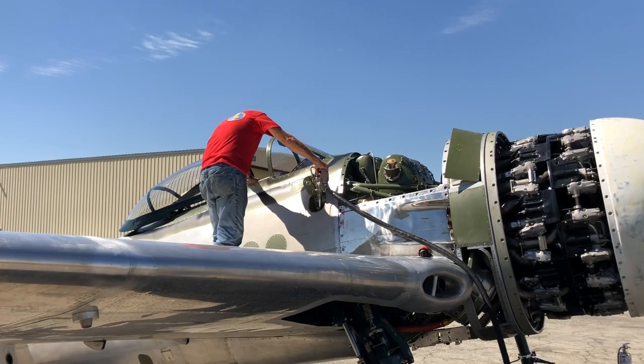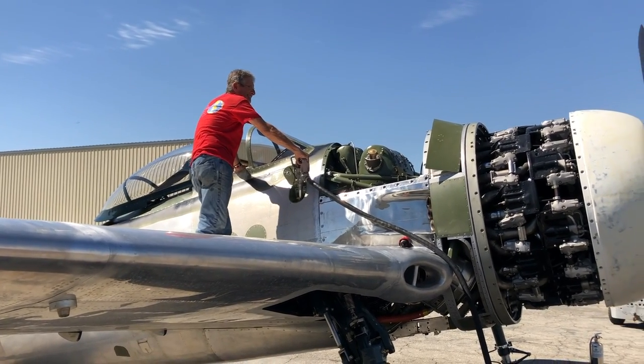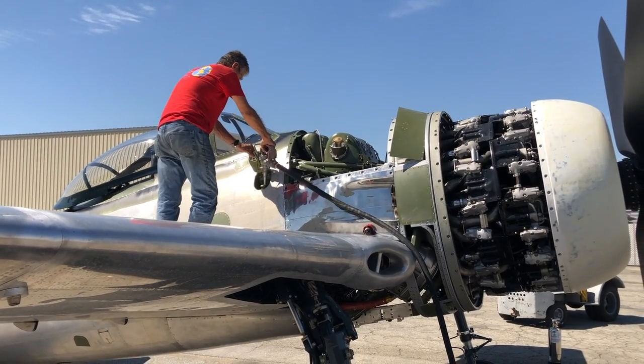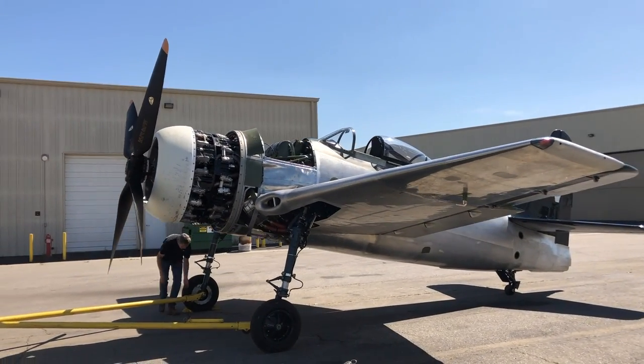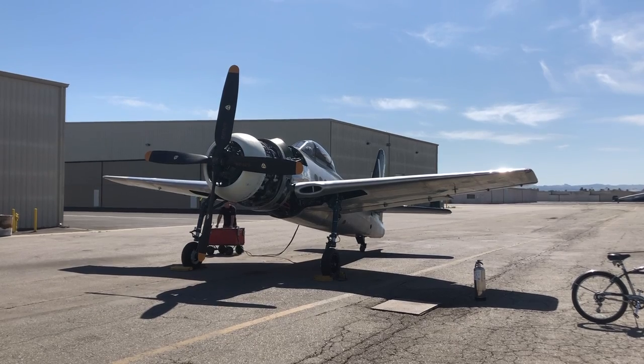Because it's never run on this airframe, we're expecting a lot of oil to blow out — which is typical with a round engine, especially a new one that's been preserved and pickled. We're putting 50 gallons of gas in it — we've had gas in it to check all the systems already but we're adding 50 more right now. The first start is really exciting. After motoring it over with the starter several times, I just turned the mags on, hit the starter, and it went about four blades.